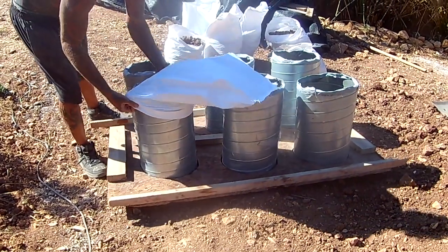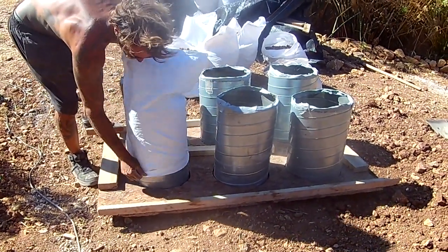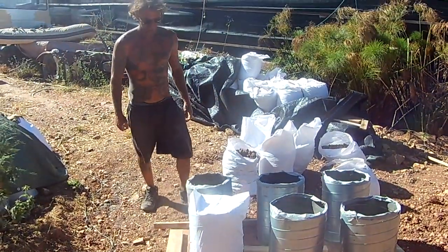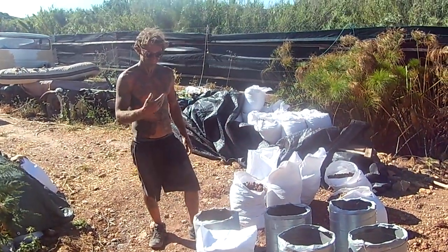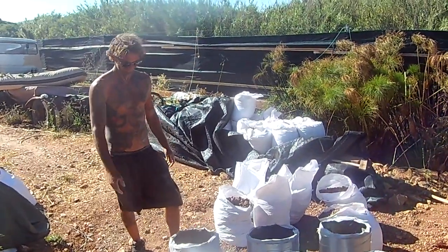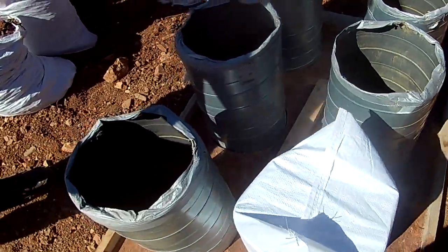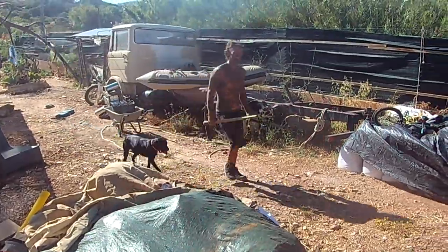The bags don't want to be filled all the way. You need to leave some space at the top. As you can see here, it's gathered a little bit when the bag is placed over. This is leaving you enough space afterwards when you lay the bag to tuck the bag under in place before you lay the next bag, as we showed you in the previous videos.